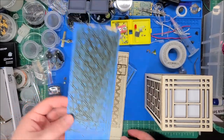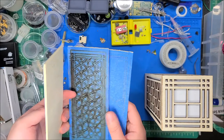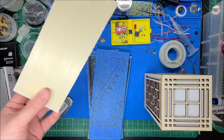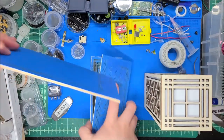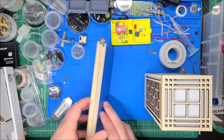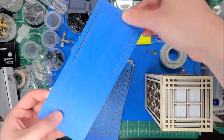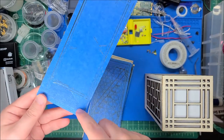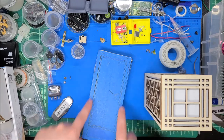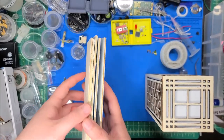I had a couple more failures due to the wood moving after cutting. The wood I bought from the dollar store is quite bowed — a lot of it is concave so the edges stick up. I added tape to hold things down, but the laser would cut through the tape leaving very small surface areas, so pieces would pop up anyway. I ended up wrapping tape along the sides like a straightjacket, and that worked pretty well.